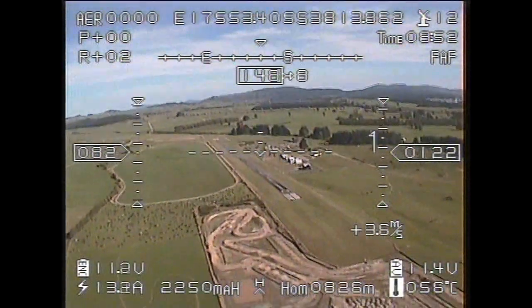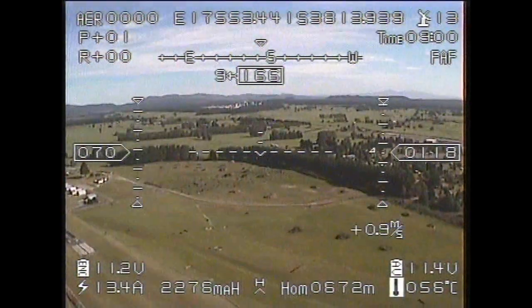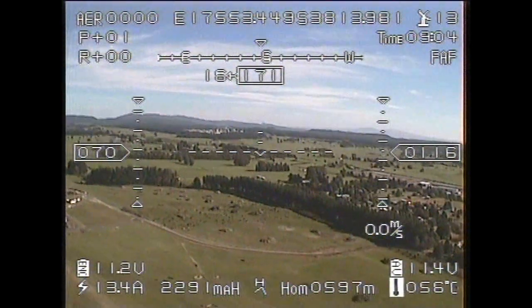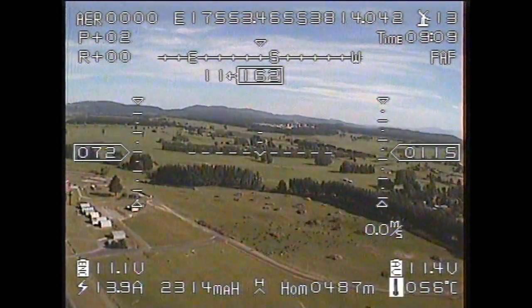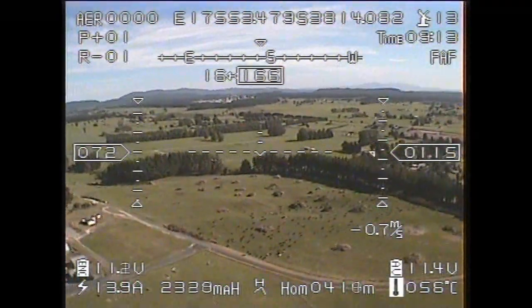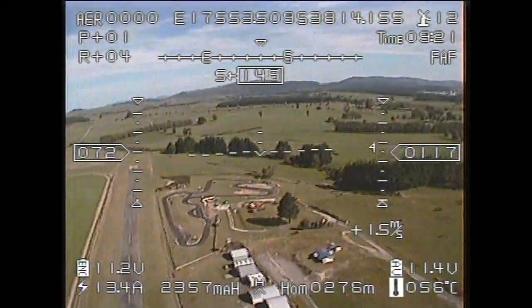At the top right of the screen, we still have 12-13 satellites in view, which is extremely good. Now, as we head back towards the receiver antenna, you'll notice the picture again starts to get a bit broken up and snowy in places. That's because we start to move into the realm of the multi-pathing, and also because these antennas tend to have more sensitivity in the horizontal plane than overhead — the closer we get to overhead, the worse the signal gets.